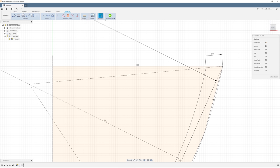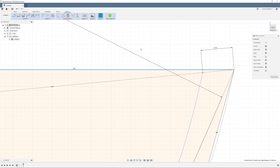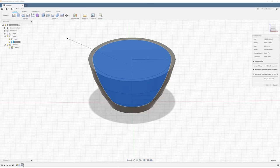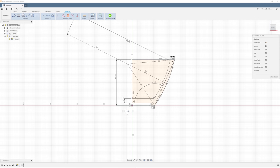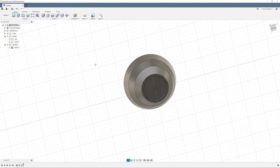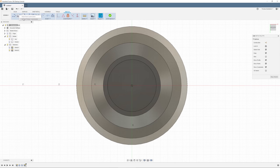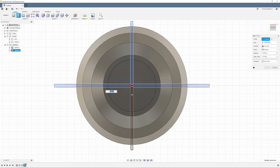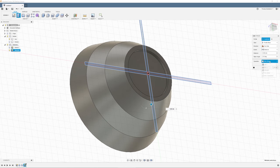It's the same problem here, and all I had to do was to detach the end of the inner arc from the construction geometry and actually attach it to the top surface of the cup. And now that I'm happy with the way this cup is proportioned — it looks functional, it looks like an actual proper espresso cup — we can start moving on. The next thing I wanted to add was some dishwasher drain channels on the underside. You know what these do on coffee cups — if you put them upside down in the dishwasher, it means that the little indented area on the underside is not going to be filled with filthy dishwasher water. So these just let stuff drain out really easily.